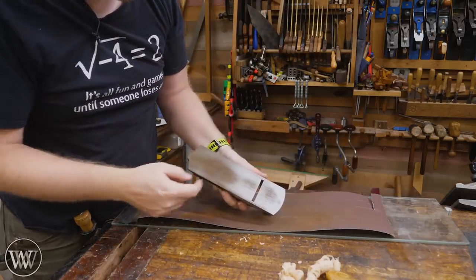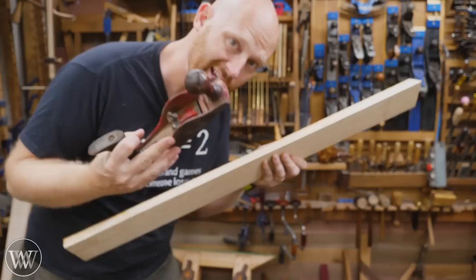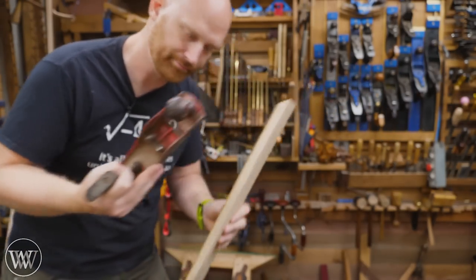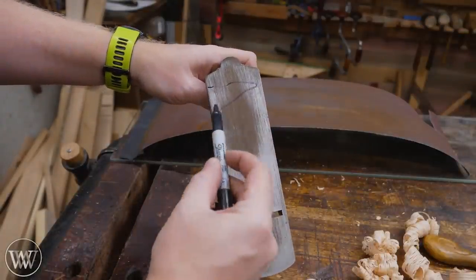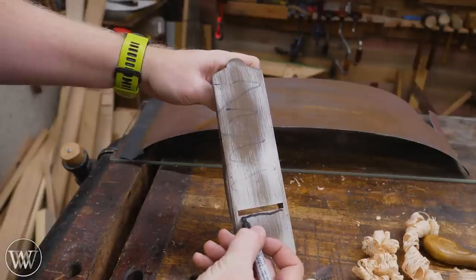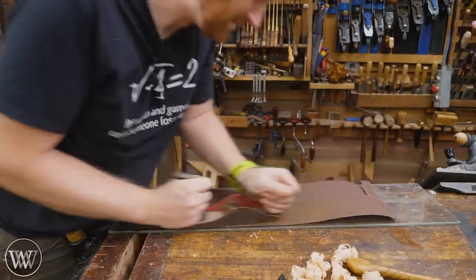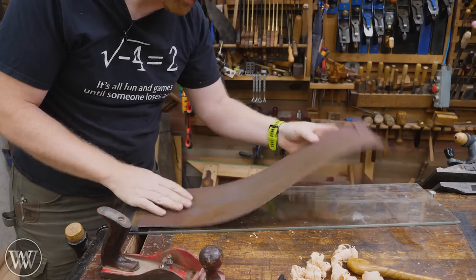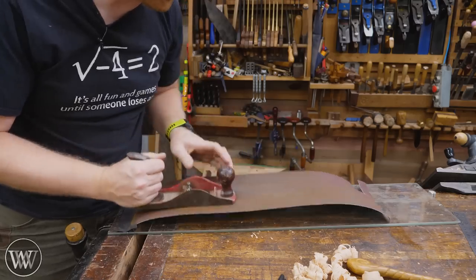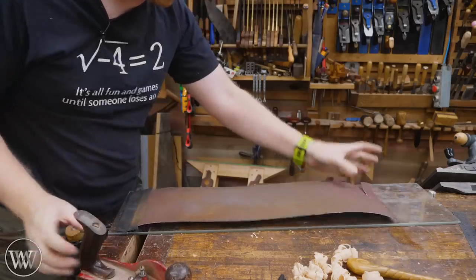Often I'm using a longer belt than this on a plate of glass. After a few strokes I can see where it's hitting. You'll often see this pattern on old jointers where it'll be shiny on the sides, but in the middle there'll be a big gullet — that's from years of jointing the edge of a board. If your sole isn't as beautifully rusted as this one, you can take a Sharpie and go back and forth across it, particularly right in front of the mouth, with a line across, then at the heel and toe. I do a few passes on the heavy grit. Some people worry about the paper not being perfectly flat, but that small amount isn't going to cause a problem.